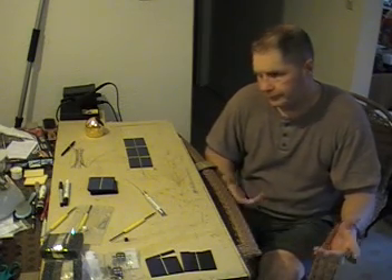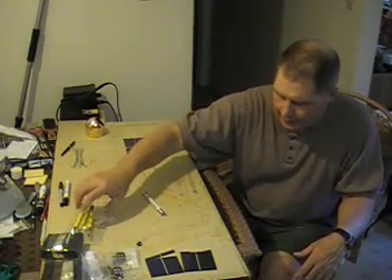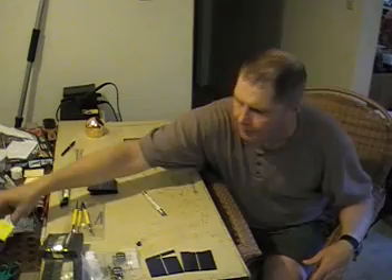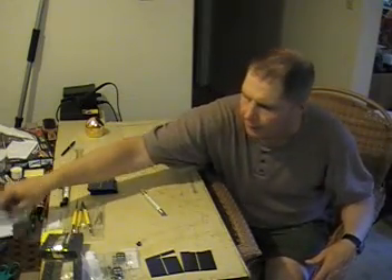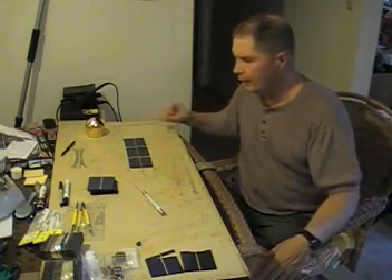These tools come in handy. I'd recommend different soldering iron tips depending on what you're doing — I use a flat tip for soldering flat wire, which makes sense. If I were doing a circuit board, I'd use a pointy tip for a smaller soldering area.